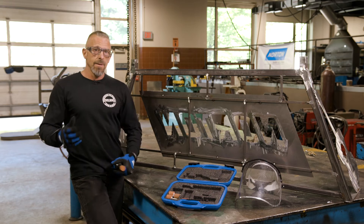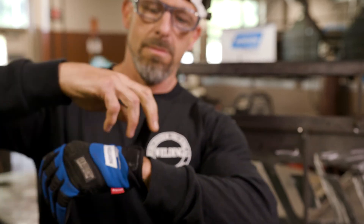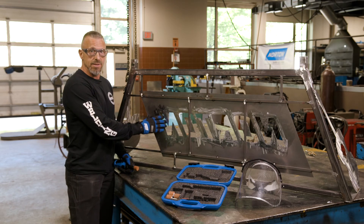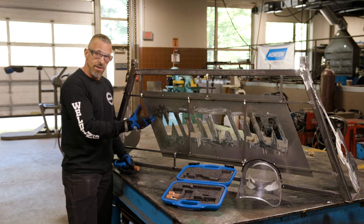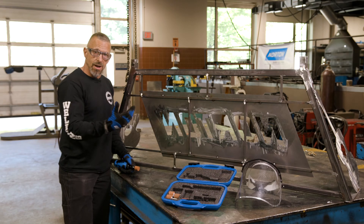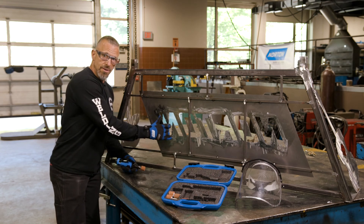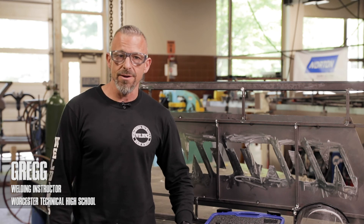You're going to want to wear long sleeves because if sparks hit you or anything flies off the grinding wheel, that'll protect you. Cotton is preferable — it's better than nylon. Most importantly, make sure you're wearing gloves. Gloves are great while you're grinding because your hands are on the tool, but also great afterward when you want to inspect the workpiece. If it isn't smooth, you could cut your hands, and if it's hot from grinding, you could burn yourself. So wear your gloves both while grinding and when handling the material afterward.